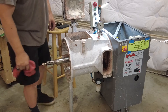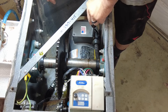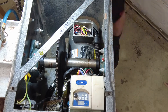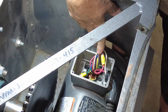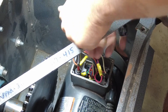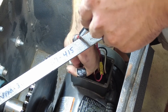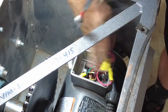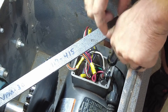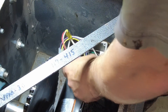I need to be able to slide this motor out of this hole right here, so the next thing I've got to do is take off this whole electrical wiring box. Now let me take out the wiring. I'm going to leave this wiring hooked up except for the ground I need to take out. There are two bolts that hold this plate on, so I'm just going to take out the ground first. I think these are 5/16ths. These are different than the bolts up here, so make sure you keep them separated. Now we can move our box - the box is off now.